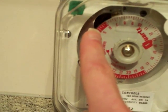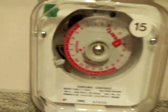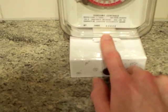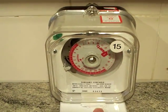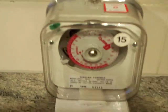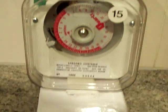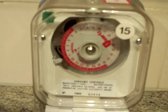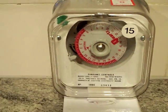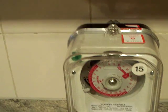This one does not have the day omission device in it — there's a little device that goes inside and you can omit a day's operation. On the top there's an anti-tamper seal, another one at the bottom, and one on the terminal cover, because these were installed by the electricity board and were not available for the end user to set. They would operate storage heaters and immersion heaters on an off-peak tariff, and when these turned on they also triggered the off-peak tariff on the electricity meter.